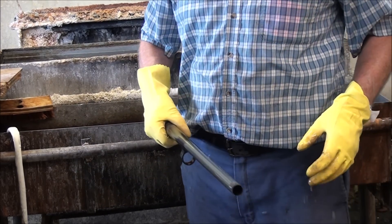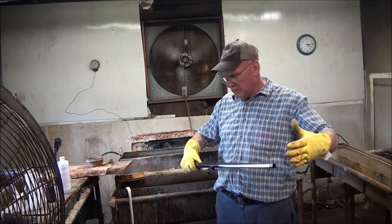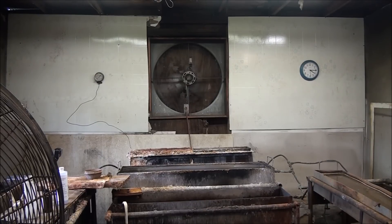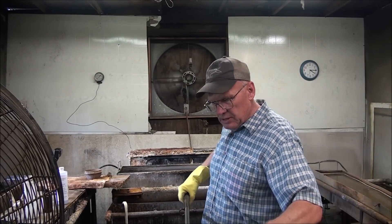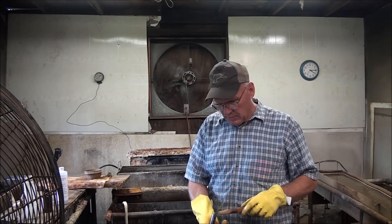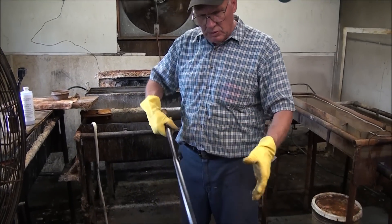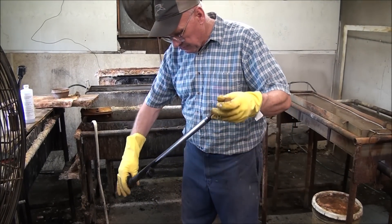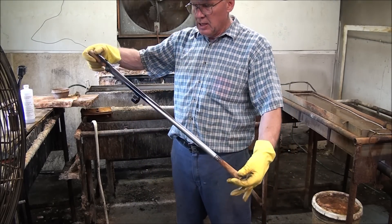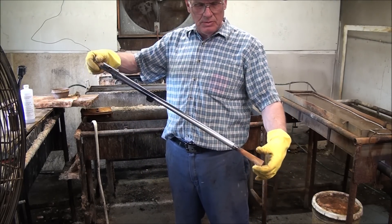I've got to step over and get a couple of plugs in here. We put wooden plugs in here — those are there for a reason. These plugs plug the bore so you don't get water and bluing solution down in it. The most important thing about them is it gives you a handle to hold on to. So while you're bluing, you handle the plugs. You don't touch the barrel. When you're bluing, you don't want to be touching your barrel.